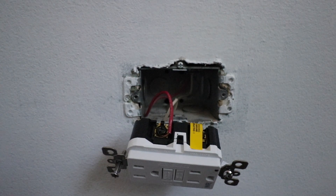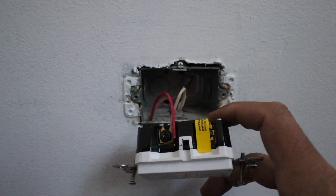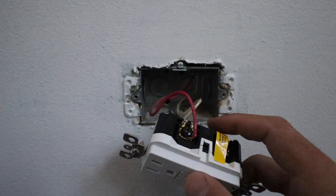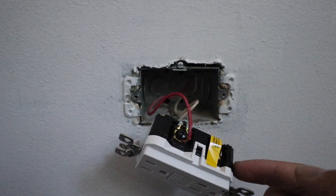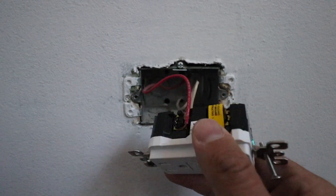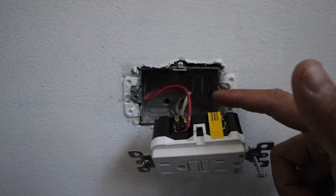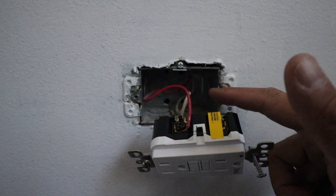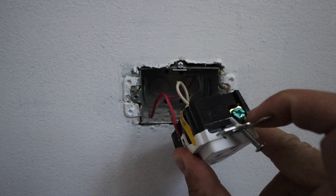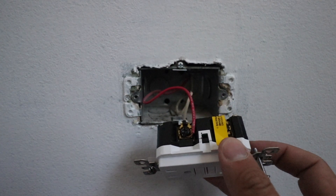Now that we've got the electrical tape off we can go ahead and loosen up the two screws — we've got one here and one over on this side. Now if you live in a state with plastic junction boxes you're also going to have a ground wire, which would typically attach to the green screw. Since we live in an area that uses metal junction boxes, the grounding of the system is through the junction box and conduit, so we do not have a ground wire on this terminal — but if you live in an area that does, just go ahead and remove that as well.